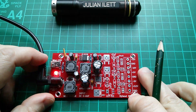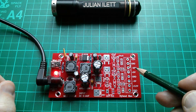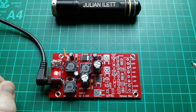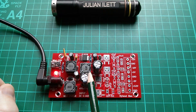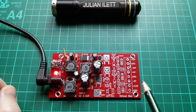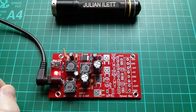I'm going to finish building this board now on my own. This is going to be very useful for my op-amp circuits because I've got plus 12 and minus 12. There's also 5 volts and minus 5, which I probably won't use, and probably won't use 3.3 volts either. These outputs should be quite good for audio because although this first part is switch mode — which will generate switching noise — once it goes through the linear regulators, that noise should settle right down and the outputs should be relatively quiet. Maybe at some point in the future I'll put them on the scope. But I think that's it for now — I think this video is probably long enough. Cheerio.